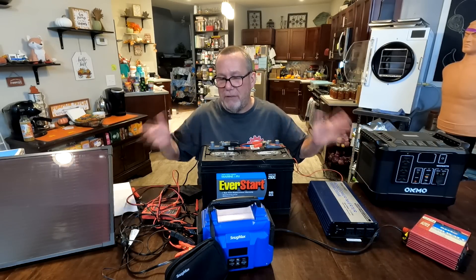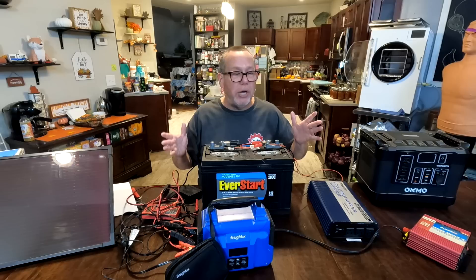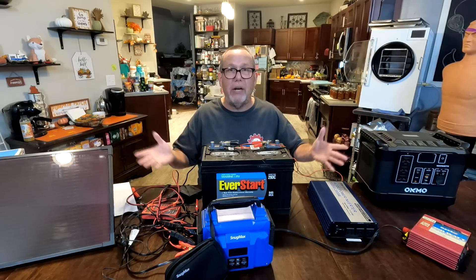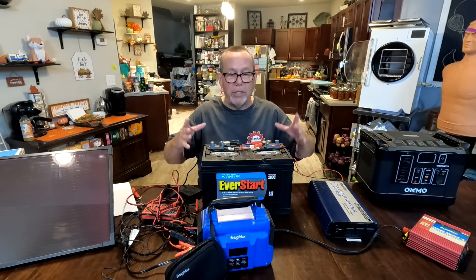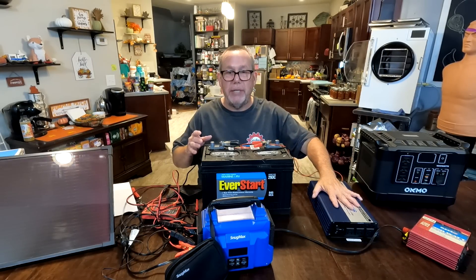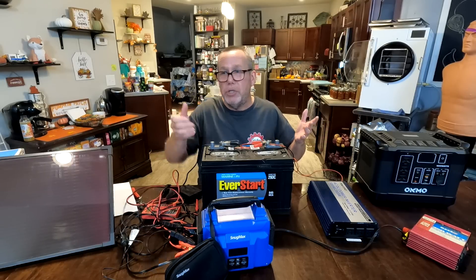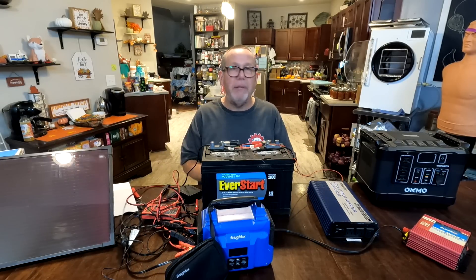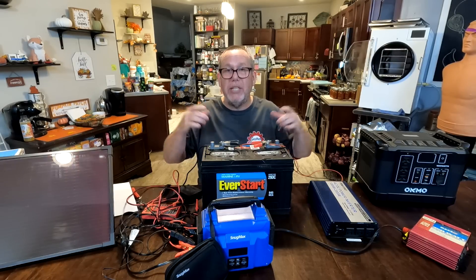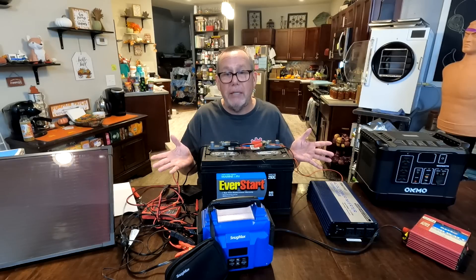This does take a little understanding to put together — there's a lot of stuff here. But if you're setting up a base station at your house that you're not going to carry around, it wouldn't be hard. Maybe in your mudroom you have a spot for a couple of batteries and the inverter sitting there. When the power goes out, run an extension cord — or if the freezer's already there, just unplug it from the wall and plug it into this system. You can also combine batteries together to make a bigger battery bank, which is what solar systems are all about and much more dependable long-term. I'm not against making a video about that in the future.